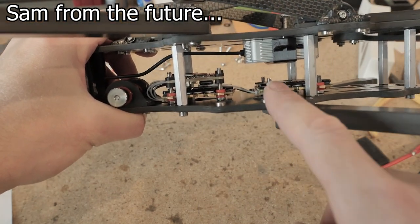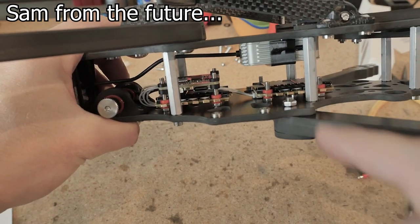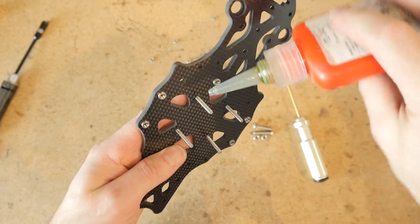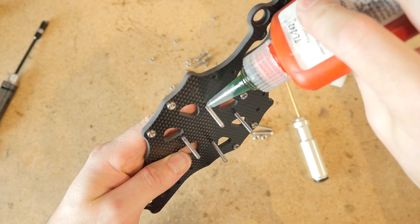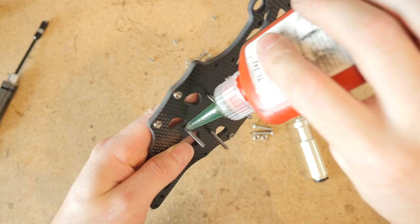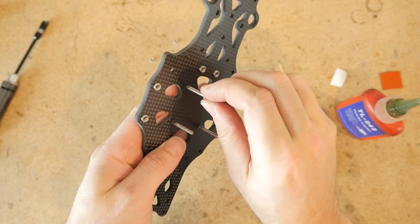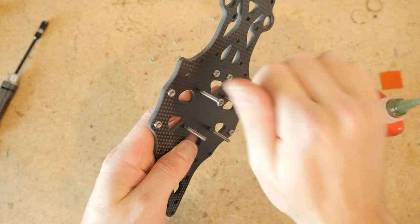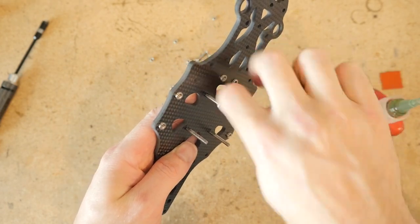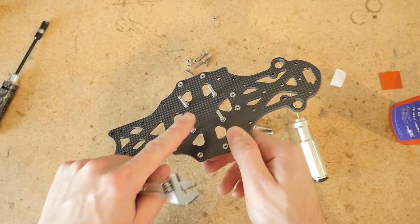So the decision is up to you. Whatever components you have, just choose your screw lengths to suit your needs. Get your blue Loctite and apply some to all four of these screws, and then once you're done with that, you can put on these M3 hex nuts and screw these down all the way, but just make them hand tight for now. Our flight stack screws are installed.